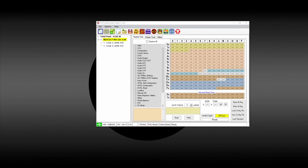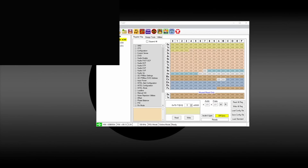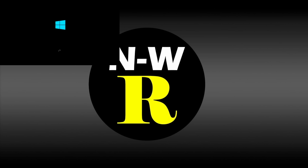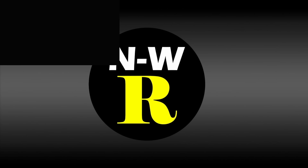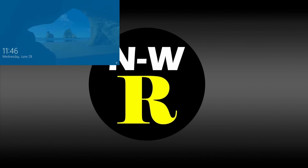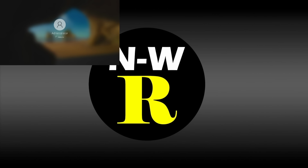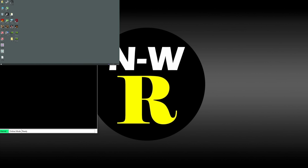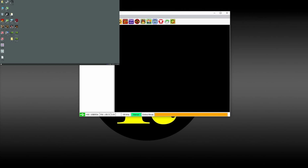What I was trying to say is that it is extremely important to disconnect your dongle while you're doing soldering with this soldering iron. It has to be disconnected, not from the board, but you have to disconnect the USB dongle, so that way you don't accidentally kill your dongle in the chip that you're programming.